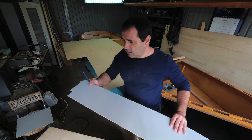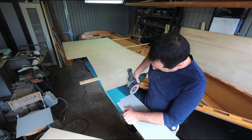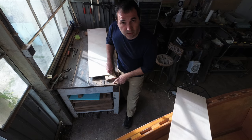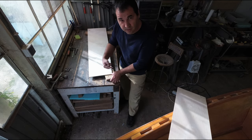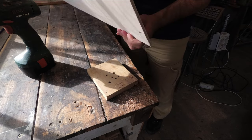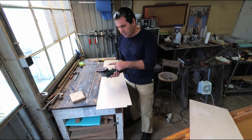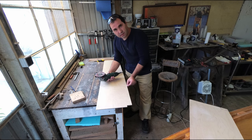I need to measure from one side of the boat to the other - that's all I need to take out of the template. The reason I put this piece of wood here is not just so I don't drill the bench - well, that as well - but it's mainly so that the drill bit has a clean exit on the other side. I'm using the angle grinder because I don't need a really nice even edge here, since there's going to be a fillet running all the way.